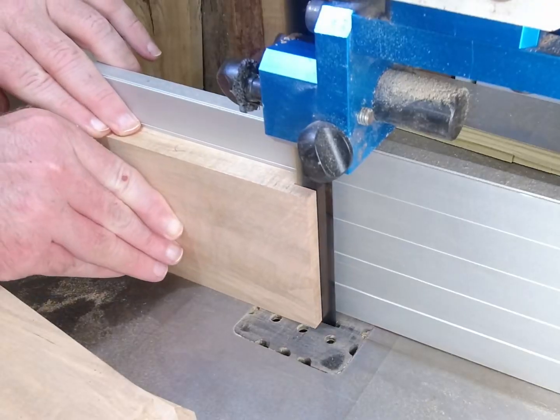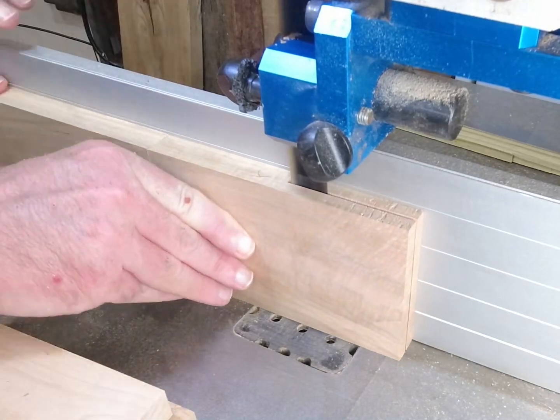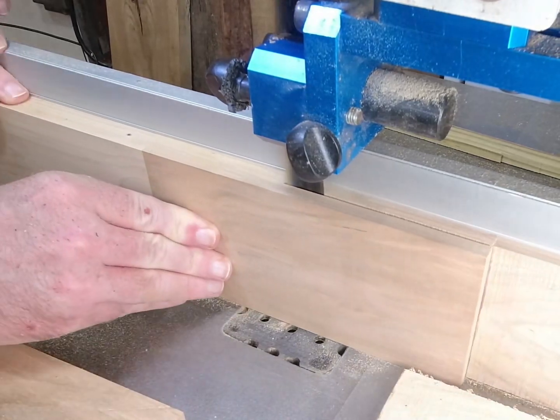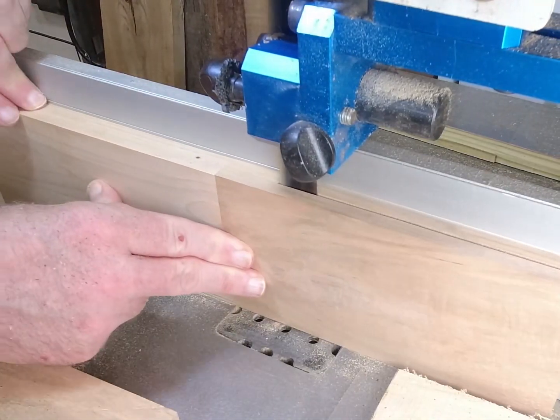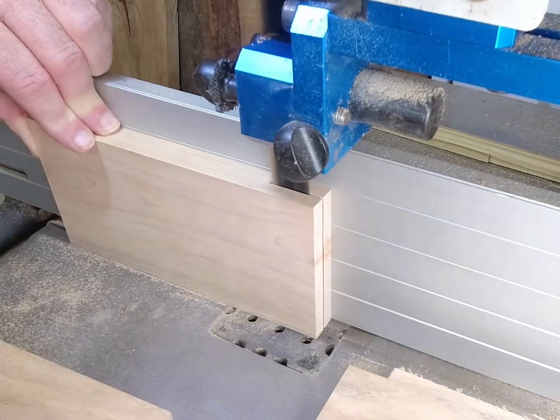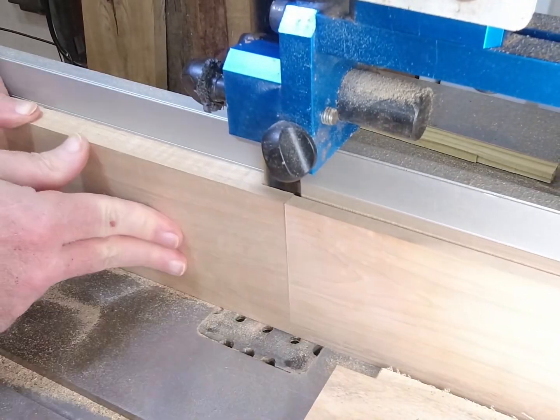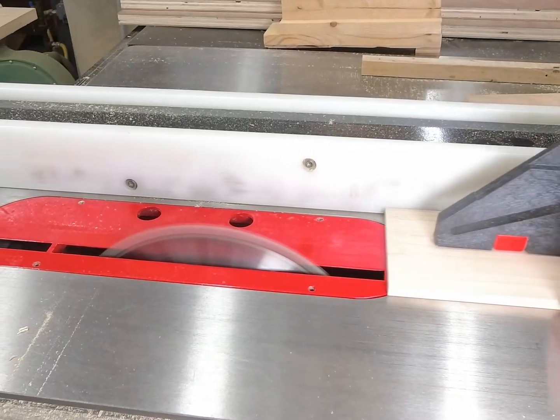Now we need to make the tenons, so I set the rip fence on the bandsaw to 5/16 inch strong. Babs makes easy work of this. I'm using offcuts and the first short rails that I messed up for the tenons. After the resaw, I planed them to their final thickness on the planer, checking as I went until the fit was right. The tenon stock is ripped to width on a table saw.